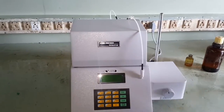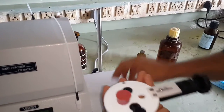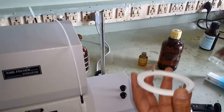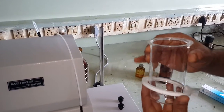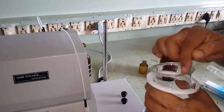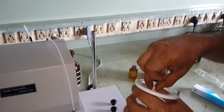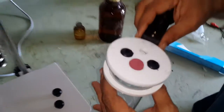This is the outlet, which we will connect to our titration set. This is a Teflon clamp — remove the two screws and the top cover so the ring comes out. This is the titration beaker in which we conduct all titrations. Pass the beaker through the ring, apply some vacuum grease on the flange, then insert the Teflon rotor inside.